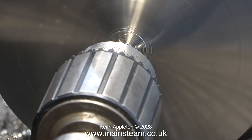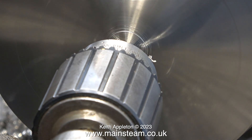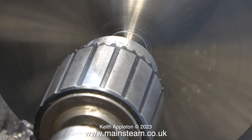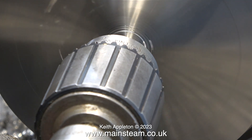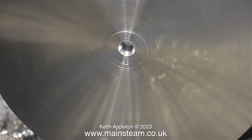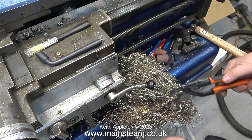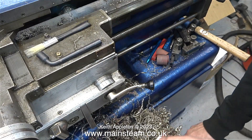What I'm doing here is centre drilling a hole in the middle of the piece of metal. I increased the feed near the centre of the work — as you can see there are lots of lines in it, but this doesn't matter because I'll be drilling a hole in this position. I was trying to demonstrate that at the edge of the piece of bar it's spinning really fast and the surface speed is high, but as you move closer to the centre the surface speed is much lower, so you can actually increase the feed.